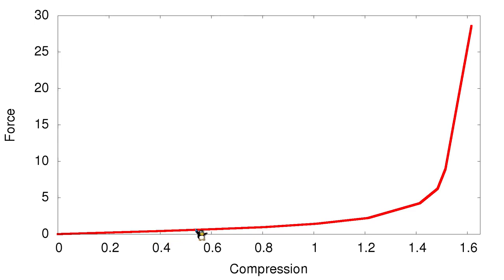As we apply more and more force, we compress the spring further and need increasingly higher force. The resulting curve looks like a hockey stick — nearly flat at first, then rising at a very steep angle. This steep rise marks the point of saturation, beyond which compressing the spring further would require something like a hydraulic press.